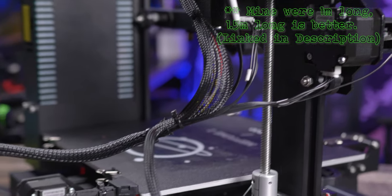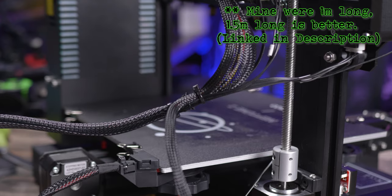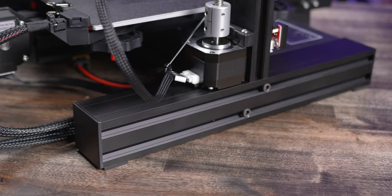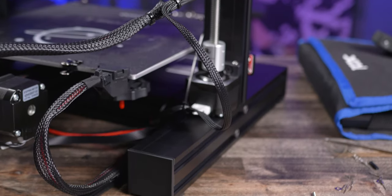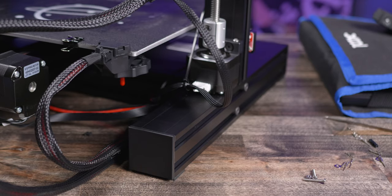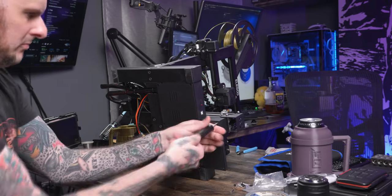I should note that the wires that came with my BL Touch for this scenario were a little shorter than I would have liked, so I wasn't able to route with the entire hot end assembly — I would have needed to extend the wires to do that. What I ended up doing is making a little loop off the side of the hot end wiring down to the Z axis motor and zip tying down to that. That was a shorter run that kept it away from the bed so I'm not worried about it snagging, and it allowed me to reach the main board. Our next step is to flip the machine onto its side and remove the bottom panel on the electronics case so we can get to the main board and make our connections.